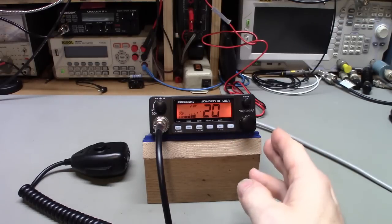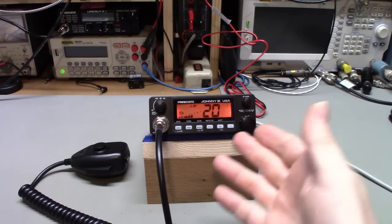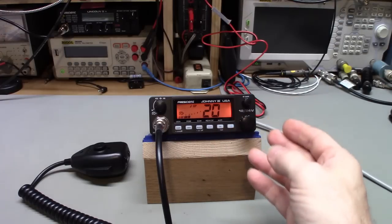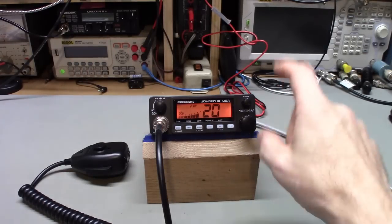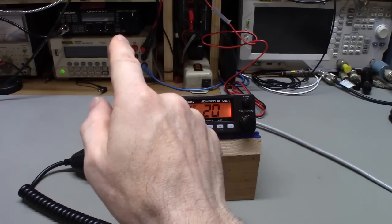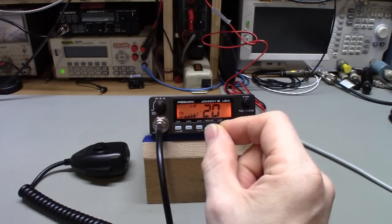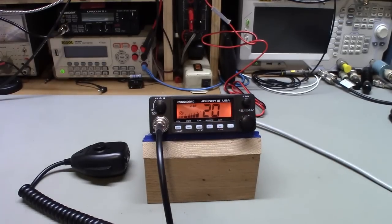Some people have said they don't like the ASC, it's too busy. Well, if there's non-stop talking, the squelch is going to stay broken — that's what it does. I compare it to a little miniature man in there listening to incoming signals and breaking squelch any time he hears a voice, because it works so blasted well. The Lincoln 2 doesn't break as well — it needs to be adjusted down, and I wish I could just turn the squelch break level down a little bit more, but I can't. This one is adjustable, so it works really well.